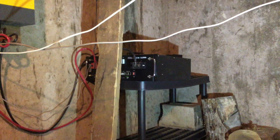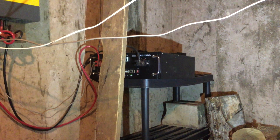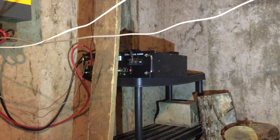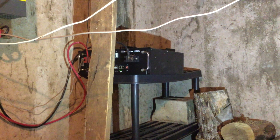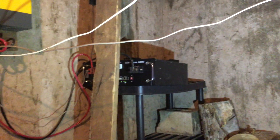So be careful when you're plugging it into your battery directly using that DC-to-DC connector. I would say disconnect it — pull the fuse on that DC-to-DC power supply before you turn your battery off and then on again — because you could fry your Solar Assistant.